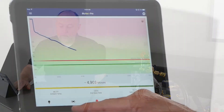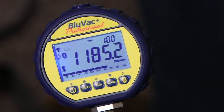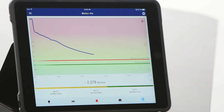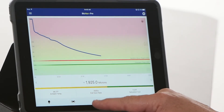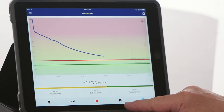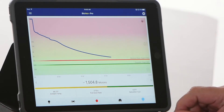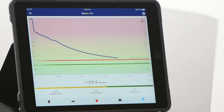I'm going to show you a couple of interesting things on the gauge here. Number one is some of the icons. This is a backlight control — we can control the backlight of the vacuum gauge, turn it off or on by tapping that button. This is our valve icon — this is the isolation valve, and right now it's open because we're pulling a vacuum. If I tap that button it's going to ask me to confirm isolation; I'll go ahead and cancel because I don't want to isolate it right now. This is our record button. This is our swap between the graph and the main gauge display. You can see now we're in dehydrating mode — in the yellow band here — this is where we're pulling moisture out of the system. And here is our gauge manager where I can see my gauges.